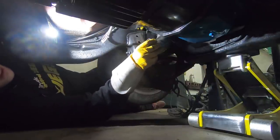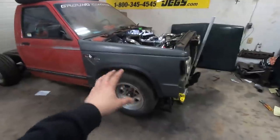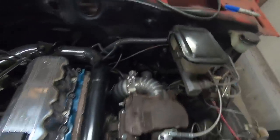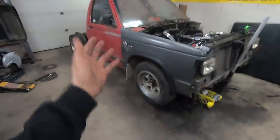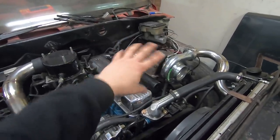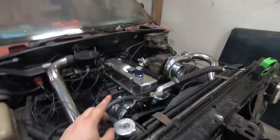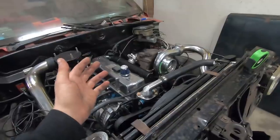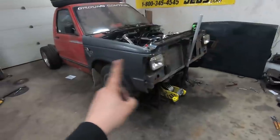I think that is where I'm going to leave it for today. I'm extremely happy with the progress that was made today. Even though just to do this one downpipe took me pretty much all week, it goes down nicely, there's loads of clearance, and it fits fantastically. I apologize for the video maybe being a little short — I used this week to develop a new skill. This is the first time I've ever tried pie cuts, and I wanted to make sure it was right. I also tested some new theories of welding stainless to mild steel — a lot of fusion weld practice and TIG welding practice. I'm going to have the nicest exhaust system I've ever built for one of my own shitboxes. I'll give you a clip of what it sounds like running right now.